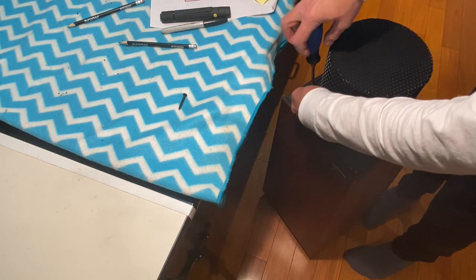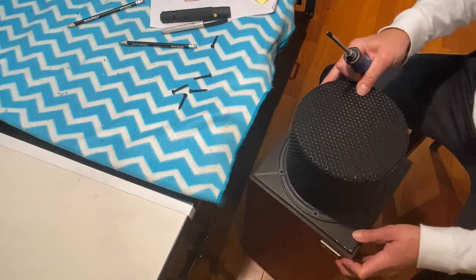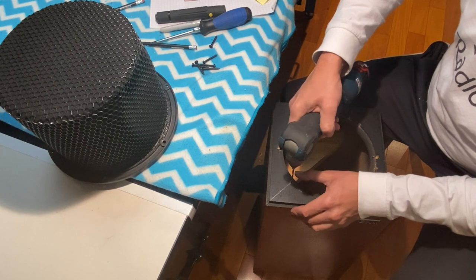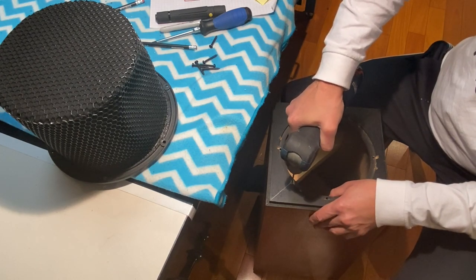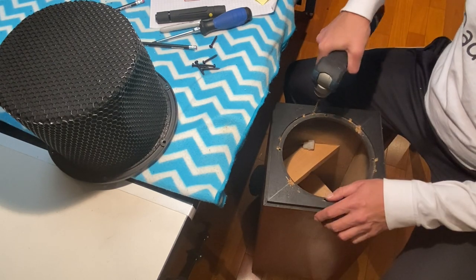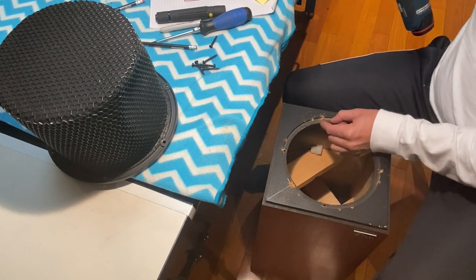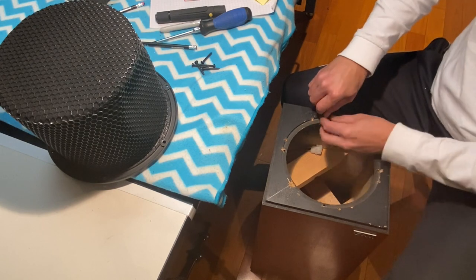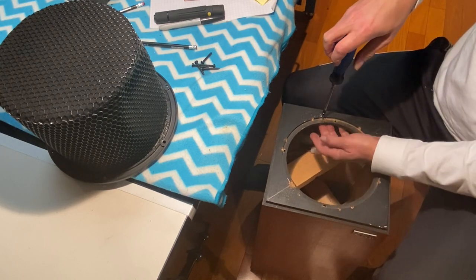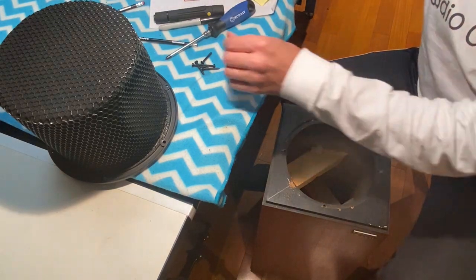And let's drill some nice clean pilot holes that go straight down. All right. There we go. Okay, one here. Yeah, nice and straight down. But you can see there's not much here. There's just a little bit of material between where these screws go in. Put one in here. And the edge, okay? So another good reason to use the pilot hole: if we go straight through with the screw without the hole there, it may be too tight and it could actually cause us to separate and bulge out. So good idea to use the 1/8 pilot hole.